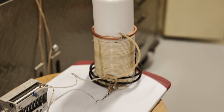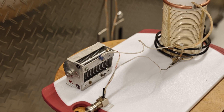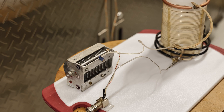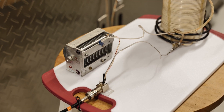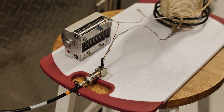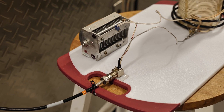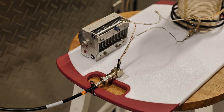Let's take a look at how this is coupled. To get a reasonable SWR of about 1.2 to 1, which is the best I can do, I'm feeding the RF from the connector through an air variable capacitor. That seems to work quite well. I can adjust that capacitor, which makes a small difference to the tune frequency but a large difference to the SWR. For 40 meters, I found that the capacitor needs to be around about 100 picofarads.